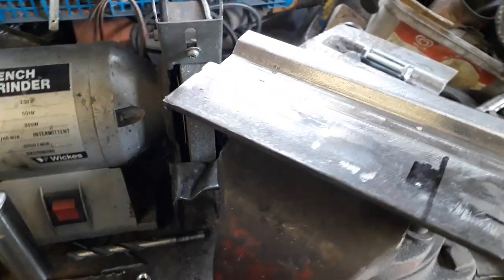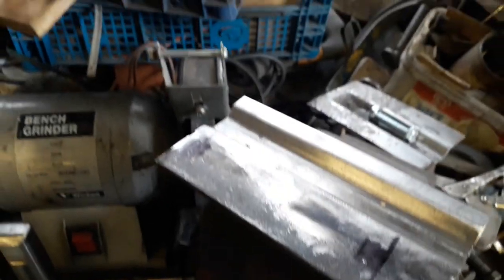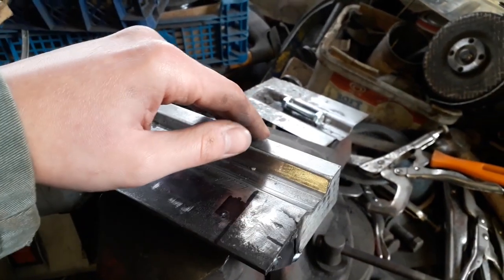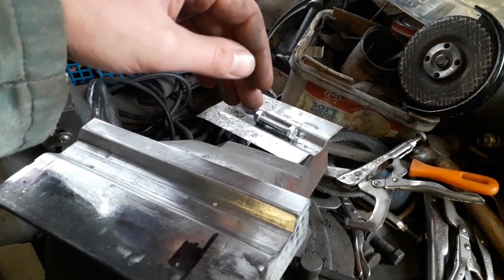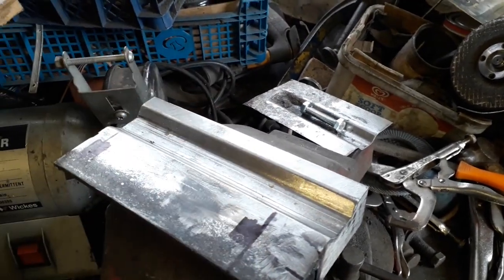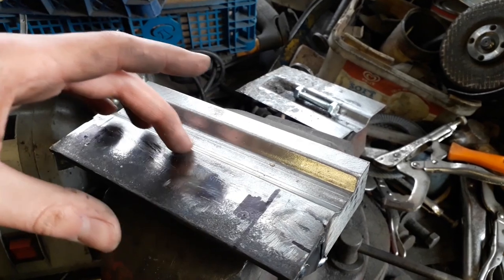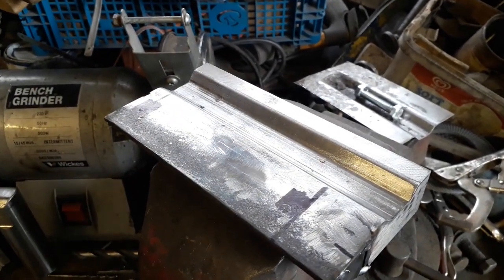So obviously when I get my piece of sheet metal, that will go in, and then I'll have my piece of wooden buck on top with some of the big washers, and then I can nut and bolt it, form this section, and then I can measure the distance from the edge of this one to the beginning of the next channel, so I can then move over, drill two more holes in my piece of sheet metal, and then hammer form that so I know the distance between the actual strengthening channels is right, so it lines up on the actual floor in the car.